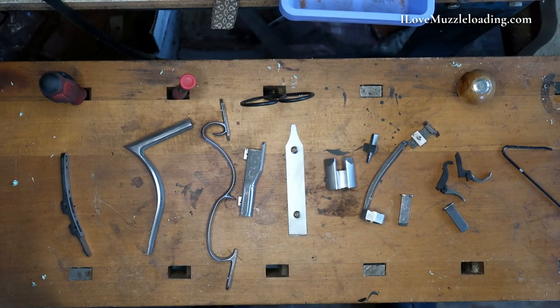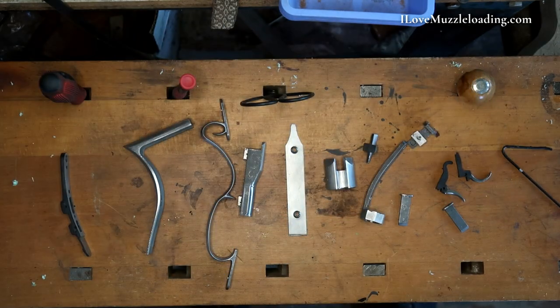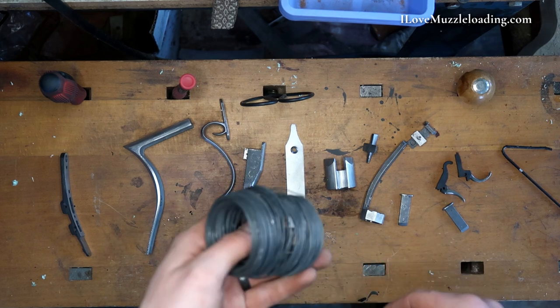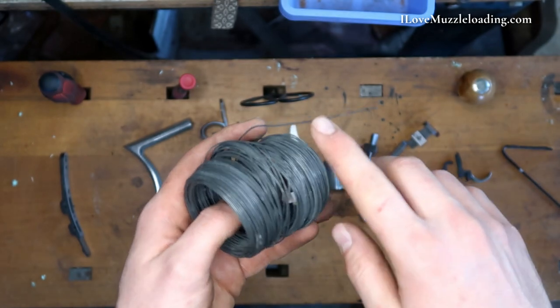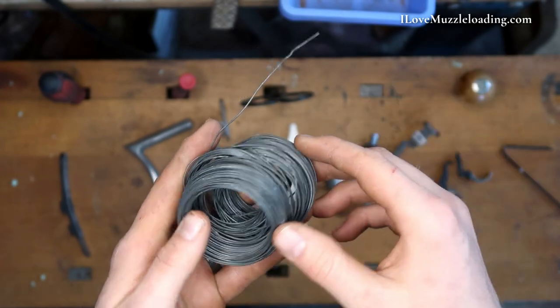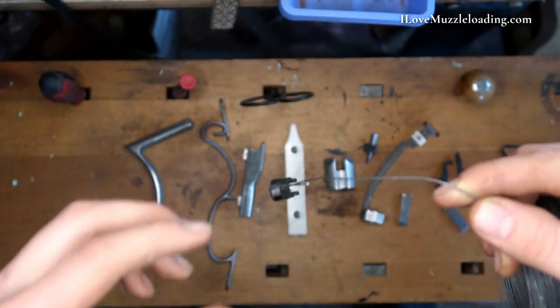As we prepare our parts for browning, we want to lay everything out so we have an inventory of our parts. Secondarily to our large parts, I have all of my screws set aside. We're going to clean up the heads of each of these screws and get them browning as well, but that's going to come next after we go through these large parts. Before we touch any browning solution, we want to make sure that we have enough wire to set up and make hooks for these parts. We don't want to be fussing around with these as they're being browned or after the solution is applied and getting them hung. I'm using some thin farm wire — there's a ton of it around and you can get it at your hardware store or local farm store — to make up some simple hooks so they can dangle and hang in our rusting chamber.